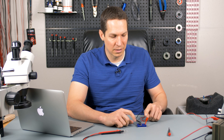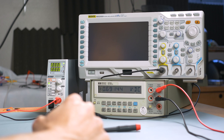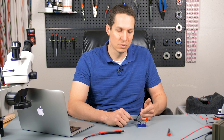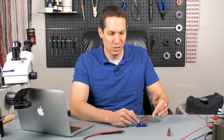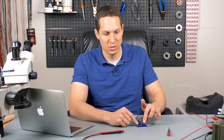The first thing is the voltage supply — whatever voltage is coming in is a variable you have to worry about. The second thing is the Zener diode itself and what it's rated for; in this case it's rated for 5.1 volts. Then we've got our load, which is anywhere between basically zero ohms and 1000 ohms. And then we have a resistor whose sole purpose is to keep the Zener diode from blowing up when there's no load and the voltage goes too high — in this case, a 100 ohm resistor.